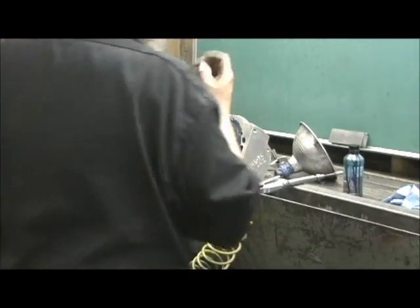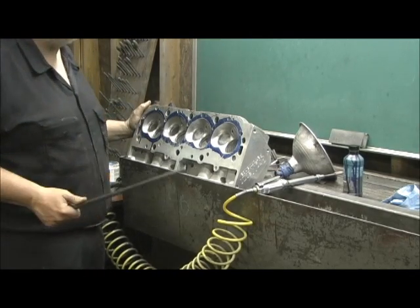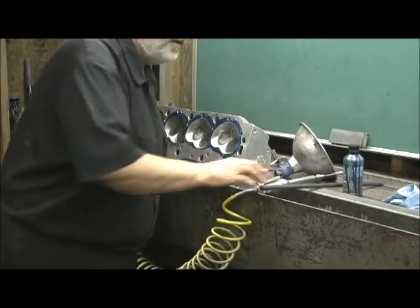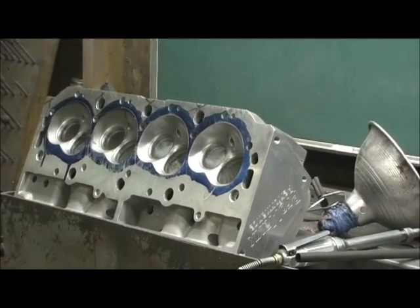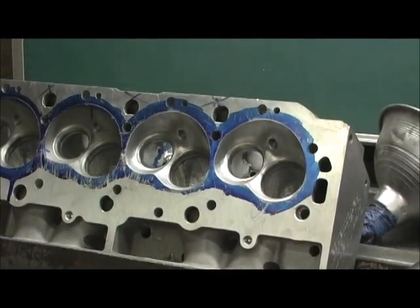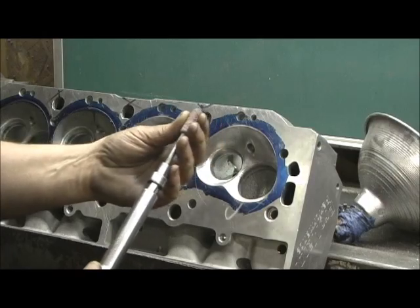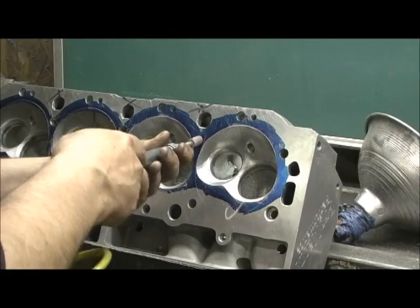I do an initial fit, which I know it won't even go in. Remember, this tube is .002 bigger than my reamer, so I do this to get that kind of fit out of it. I use the 50-grit rolls and trim them down where they'll barely fit in that hole.